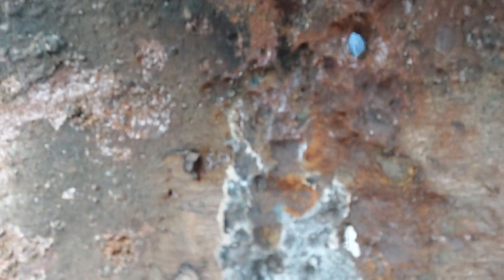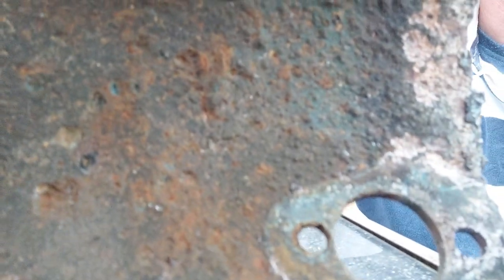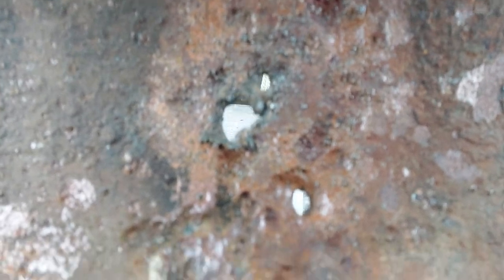What's really interesting is obviously the extent of corrosion. But if you look further inside the tube, where we've had it removed, there's barely any corrosion — just a few little pits, nothing massive compared to where the bow thruster propeller was moving. And that's from where the bow thruster has been moving and thrusting around, chucking all that grit and dirt and stuff into the wall of the tube.